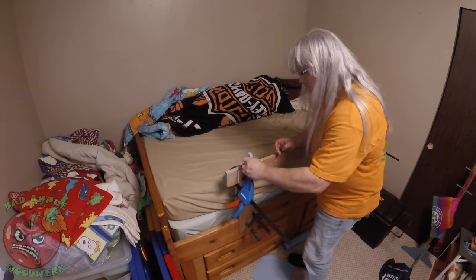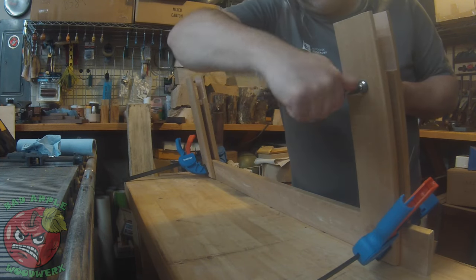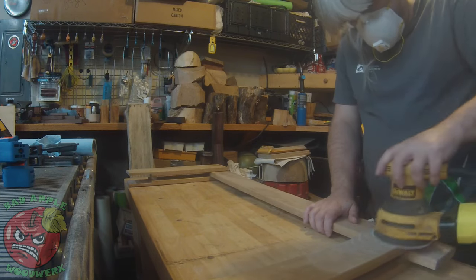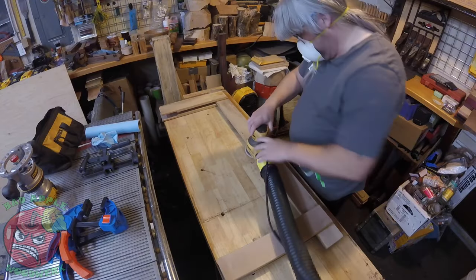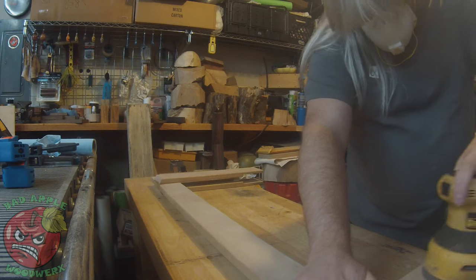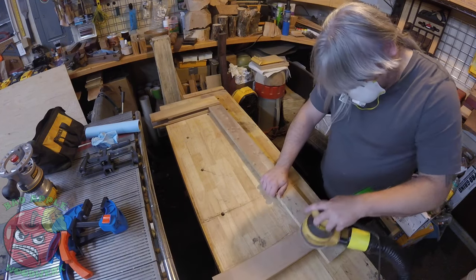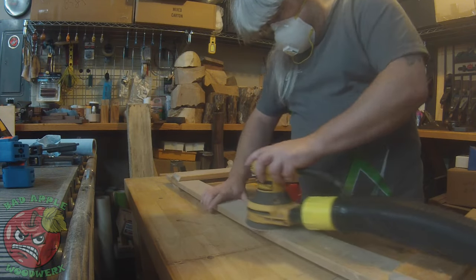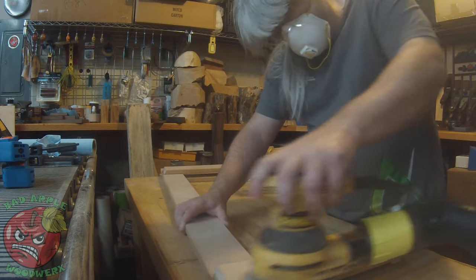Make sure to clean up all your squeeze out. I let this sit overnight just clamped up right there so the glue could dry and I knew it was in the right position before I moved it. Then back to the workshop, take all the clamps off. Now it's time for the sanding. Like I said, I found this at my local lumberyard — it was listed as S4S, or surface four sides. Their version of surface four sides and my version are a little different; this thing had all the edges rounded over and was pretty much finish-sanded. The only real spots I needed to address were the cut ends, and then I'm just hitting it with 220 grit to clean up anything from working the piece and bumping it into things. Not a lot of sanding on this — just a little overall buffing to get it ready for finish.